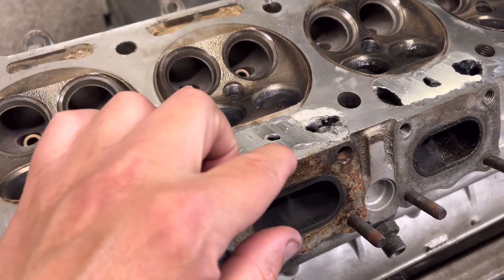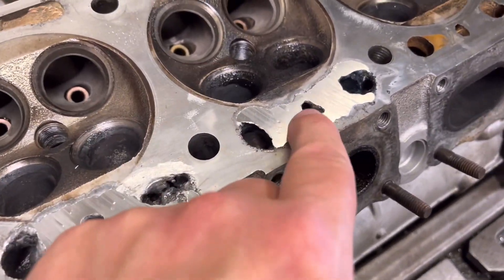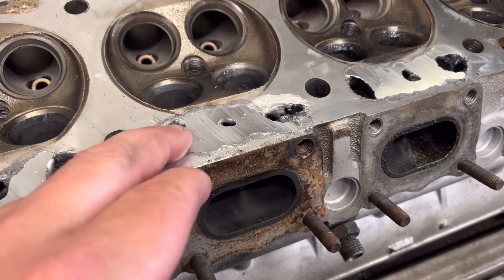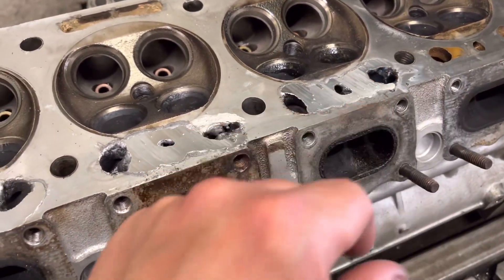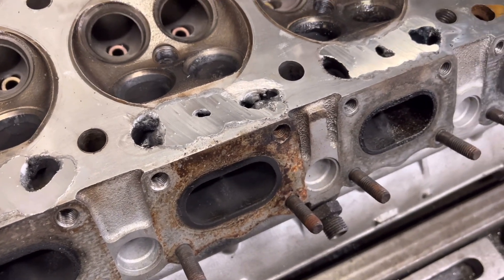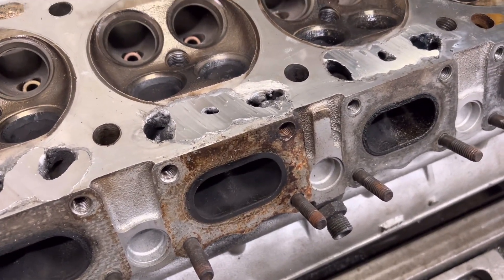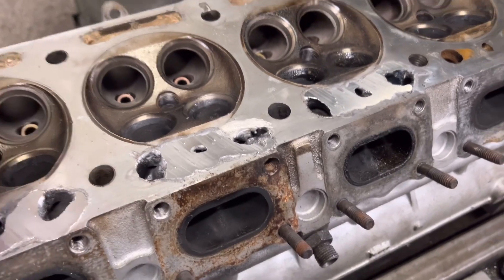Isaac's taken it down now — we're probably within about 5 thou of the surface and I don't think we need to go any further. I'm actually surprised because underneath that weld it's gone back to all pretty fresh material. There's not much crap in there, just a few little blow holes. I'm going to dig this out — even if we have to fill in all of this, it's fine because I've got the drawings to remachine all the holes, so it's not a major problem. It's actually not as bad as I thought. With all that weld built up on there it looked horrible and I thought we were running into the realms of a new head here. But no — that's fairly promising. I'm going to give Mark a ring, get him back in to weld it up again, dig this little lot out, and see what it ends up like — maybe not as bad as I thought it was going to be.